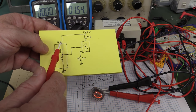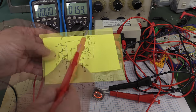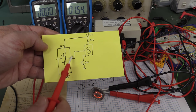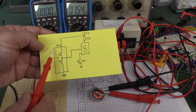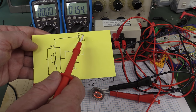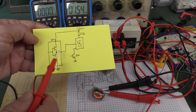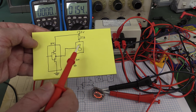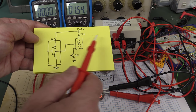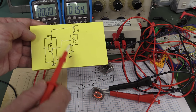So you could potentially hook that HV pin back up to the other side of your dropper over here. But the problem with that is these, as you saw on the Microchip datasheet, have a high number of output drivers on the one chip. They're like 32 or 64 output drivers, and you've got separate dropper resistors for each one of your Nixie tubes like this. So you'd have to dedicate one chip to one Nixie tube to be able to tie that individual pin back. I wouldn't like to tie them across multiple Nixie tubes. You could probably get away with it, but